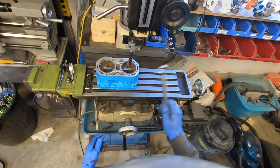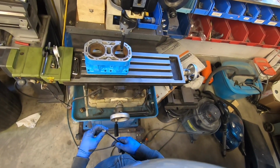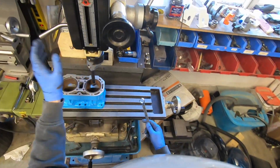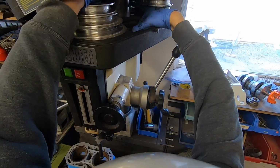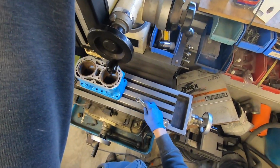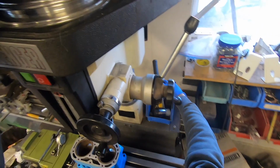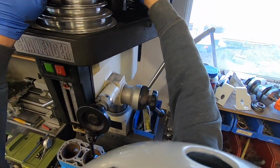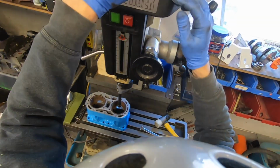Okay, so as I was saying, I have a column mill, and because I can't raise or lower the head, that means that I need to remove the boring head without lowering it. So I need to raise the cover and try to get in there. Bit of a pain in the butt. There's hardly enough room to swing a hammer to release the drawbar. Oh, I got it.